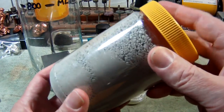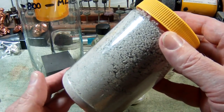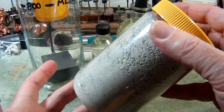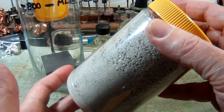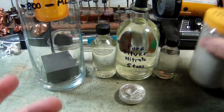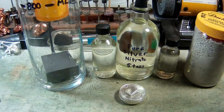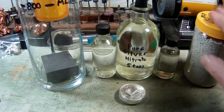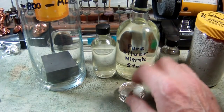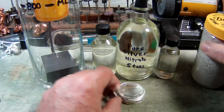This is my refined powder, probably up to 99.7, 99.8 — anywhere from 99 to 99.1 all the way up to about 99.8, and some may even be 99.9. But I want to mark my bars or castings 99.9, and the only way I can be absolutely positive of that, if I'm getting it from refined silver, is to put it in this silver cell.